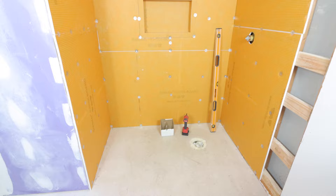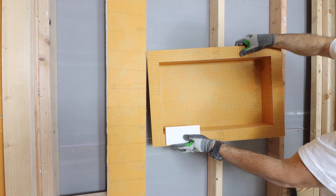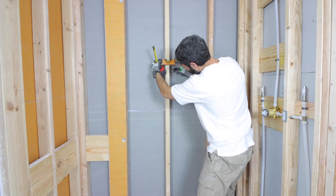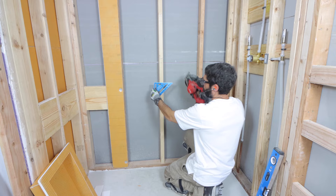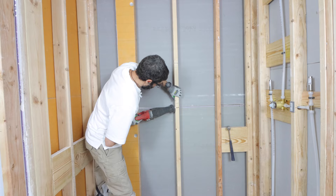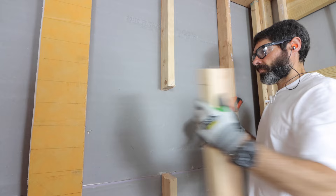After leveling the floor, the next step was to waterproof the walls with KERDI board. If you're using a shower niche like I am here, I recommend using a story pole to help you position the niche where you want it in relation to your tile layout. I'm marking the location of the niche on the studs and cutting those studs using a variety of tools. I use a square and a circular saw to make the initial cut, then complete it with a reciprocating saw — though often an oscillating multi-tool works best after that.